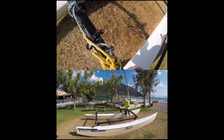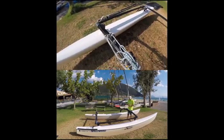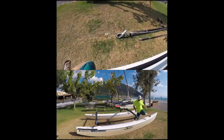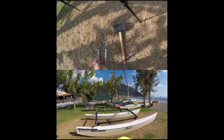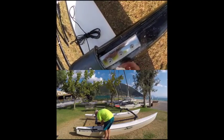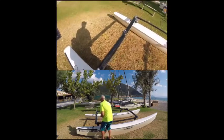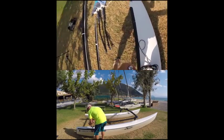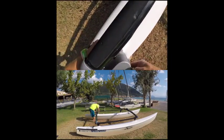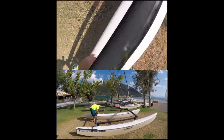If we were leaving the boat assembled, then we just leave it all on the trampoline. They'd be quite happy there, but because we're taking it apart, we have to do these things. All right, so next we're going to take the bolts for the beams off. These are 17mm bolts. The plastic nut should just be finger tight. Yeah, so this one's finger tight. And then what we'd usually do with these is leave the nuts and bolts actually bolted through the back lacing strip of the trampoline, but of course we've taken that off, so we can't do that. Right, so I'm actually going to leave these just on the rudder for now, and then once we've got the beam off, I'll just pop these back into the beam. Again, we're putting as little stuff on the boat as possible, so we'll put these on the beam rather than leaving them with the hull, sorry.